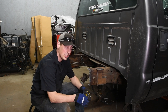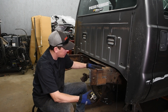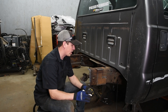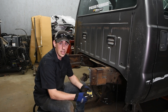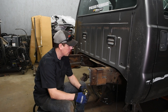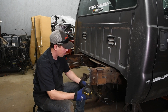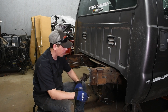If you guys remember from the previous episode — if you didn't see that one, I'll put it up here and there will also be a link in the description below — I made up this template so I can make sure that I cut the frame here the same as the new piece of chassis that I'm welding on. Now I just want to give a little bit of a disclaimer here: this is not for somebody that's not confident with fabrication. Modifying your frame can be very dangerous. Definitely don't try it if you're not comfortable with this kind of stuff, and obviously do so at your own risk either way. But as I went over, the safest way to do it is with a notch like this. If you just do a straight cut, the weld goes in one direction and there's more of a chance of it breaking off clean next to the weld. Usually the weld is the strongest part, but you can stress the metal and fatigue it next to it.